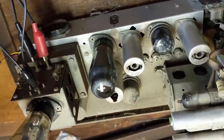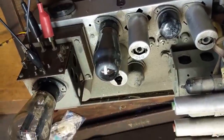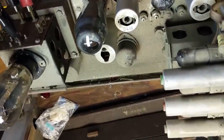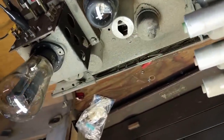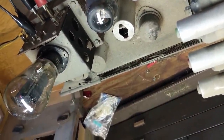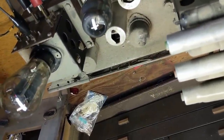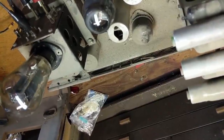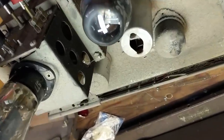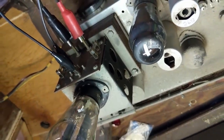This might be a quick video. I powered this up again and nothing — no filaments. I started hearing a little bit of a crackling noise about halfway up, then turned it off. Smelled what smells like a crispy transformer. The only other option here is maybe there's a bad loose connection in there. This is not easy to get at — I think I'm going to have to try to remove this front panel off and see if I can get to any of these leads to see if any have worked themselves loose.